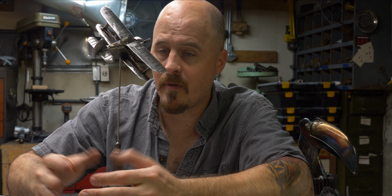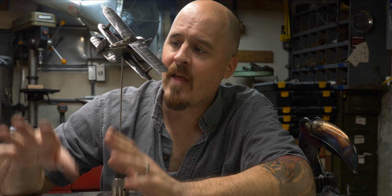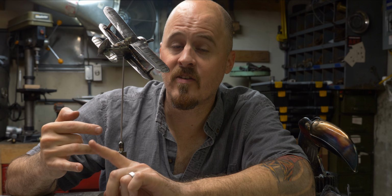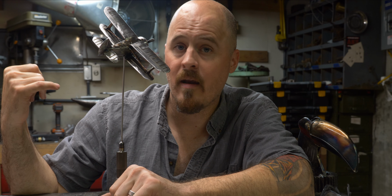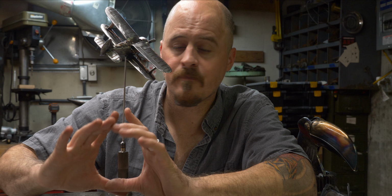You may have some little cleanup to do, some weld spatter here and there to clean up, but time spent in the beginning doing the monotonous stuff, standing at the grinder for 5 hours and cleaning and shaping things, it pays off in the end. And this is a pretty simple sculpture. You could make this with an angle grinder and a MIG welder. You don't have to have a bandsaw or a belt grinder for this. If you have an angle grinder with cutoff wheels and flap discs and a gas shielded MIG welder, there you go. And time, and 2 days of time.